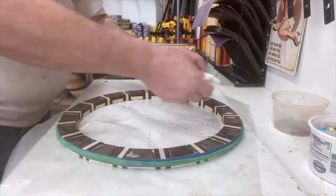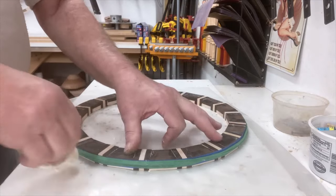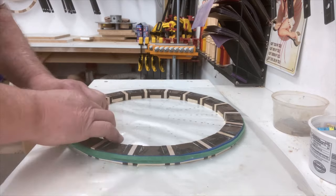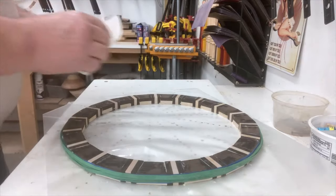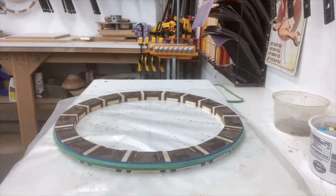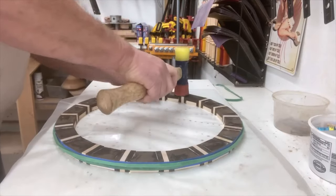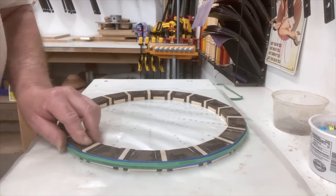And so this is an 18 segmented ring that are cut at angles, 10 degrees, I believe it was, and then 18 straight sided non-angled segments until the 36. And take a hammer, I do give it a little bit of force. One of them slid off. We'll make good. Make sure it lays flat. I'm not going to worry about that rubber band that comes loose. Not at this point in the game. It's got plenty of clamping hooks on it.